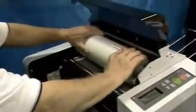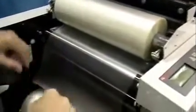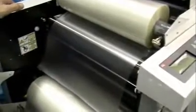After putting the bottom film behind the idler roller, go to the rear of the laminator and to the rear cutter, and put the cutting blades in the film set position. This positions the blades away from the web of film and the threading card, which prevents any potential jamming.